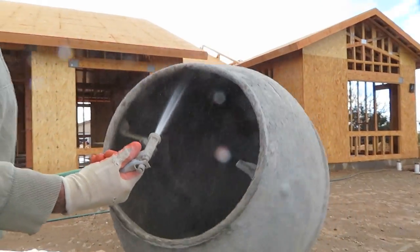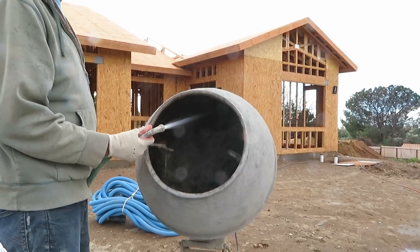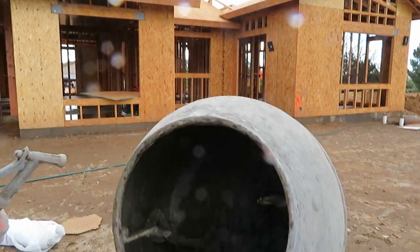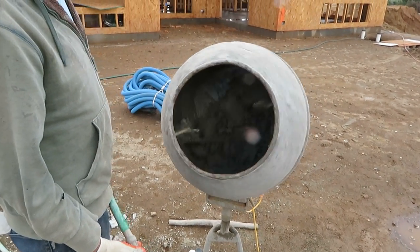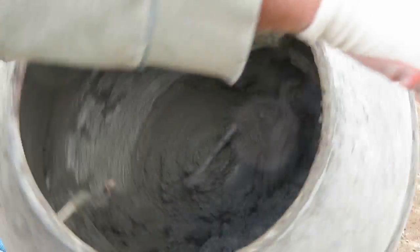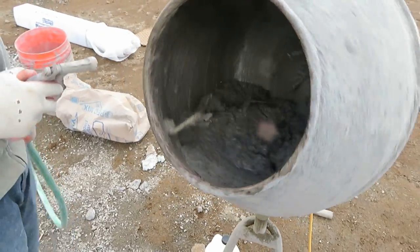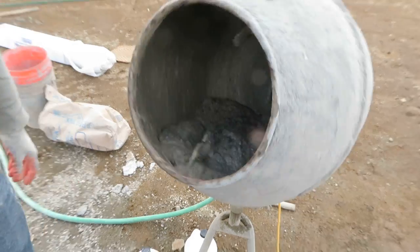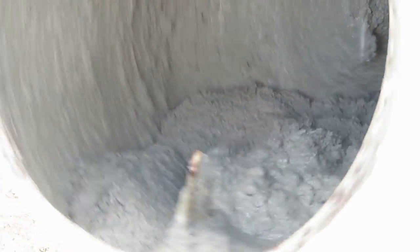We've got our 94-pound bag in the mixer. Now we're coming back with some water. What I do is spray it on this outer top edge with the nozzle of the hose, start right here and then move back slowly to that back corner. That gives us a chance to rinse it off the drum — and that's a good thing, to not have it stick. You want it really snotty. So now you can see we've got a real wet mix, and that's what we want.